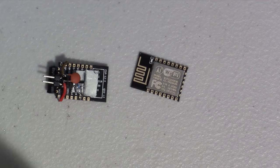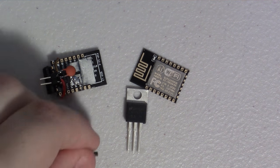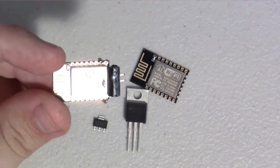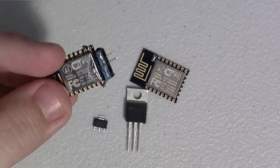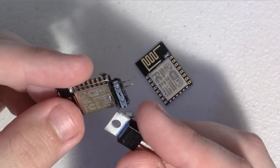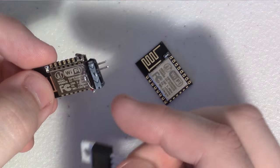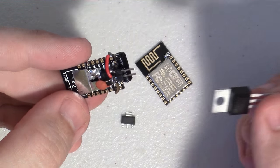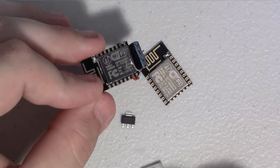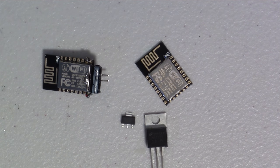In doing this I've been trying to get away from using the larger LM1117 and instead replacing it with the much smaller AMS1117. I made this choice because I want everything to basically fit nice and neatly on the ESP-12 package. Unfortunately the tab on these is the output voltage, so I can't really mount it on top of the shield here which is connected to ground, and I don't really want it taking up the bottom either because I have a couple of capacitors I want to put in. So I've been going with the AMS1117, which is basically a surface mount replacement for the LM1117.